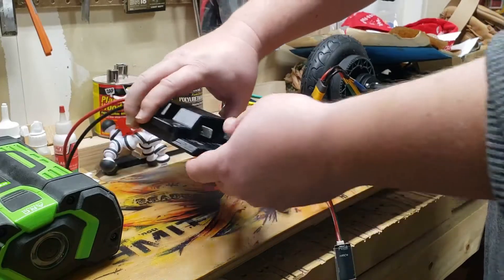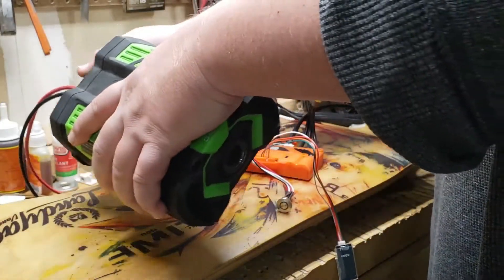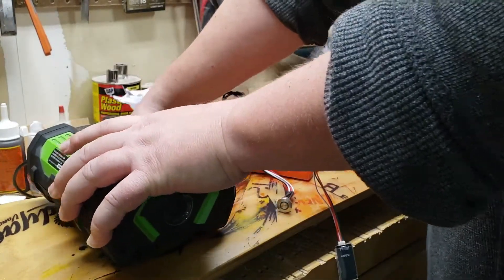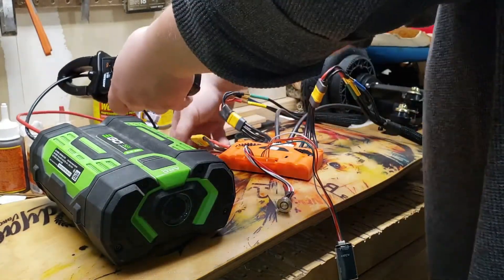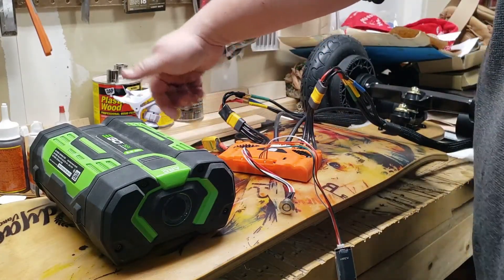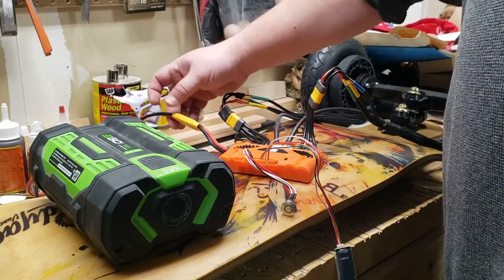You need the battery source. I got a mount for Ego batteries off eBay. Today I'm using my two and a half amp-hour Ego battery, just to try the smaller one. I also have an amp sensor here to see how many amps this is actually drawing while running. It uses an XT90 connector that I had to solder — the mount just comes with bare wires, and the FOC box comes with the XT90, so you have to wire those yourself.